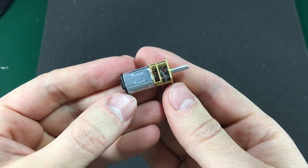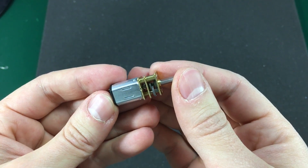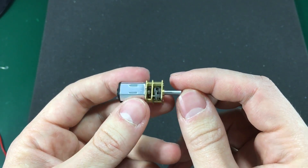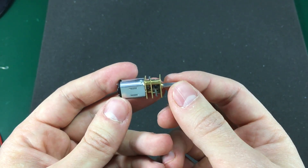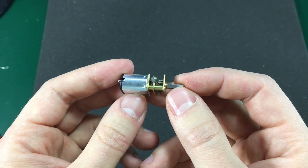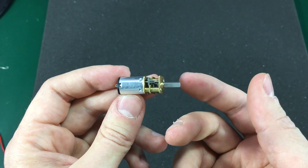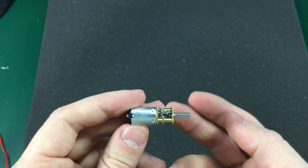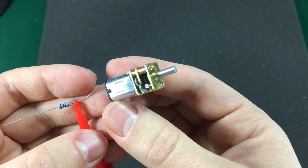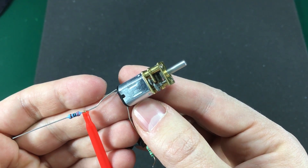I also got this small geared DC motor and I didn't realize how small it was from the pictures. It's rated 3 to 6 volts DC input with 40 RPM on the shaft. You can also find these with different gear ratios and different input voltages. I think this one would be too small for the automatic blinds task, but there are plenty of other choices available on Banggood, so it should be easy to find a motor with the appropriate size, RPM, and torque. Let me show you how this one spins — I find it interesting to watch that small gearbox working.